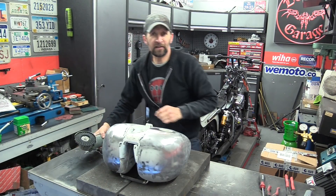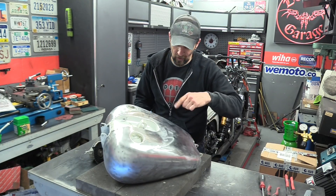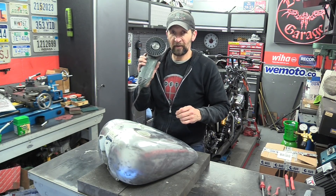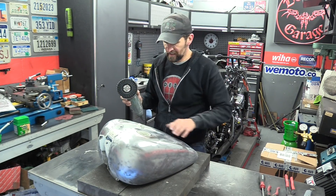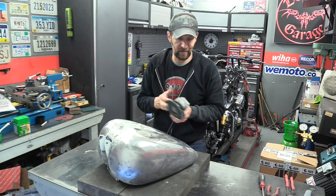Right, here we are — a lot less fuss, I think you'll agree. But that scuff pad does leave a lot of swirl marks, and I want to take those out if I possibly can. I'm going to go over the whole thing with a fine grade scotch flap disc just to take out any last remaining bits of paint and give a nice uniform finish to the steel, and then I can start putting the pattern in the sides.